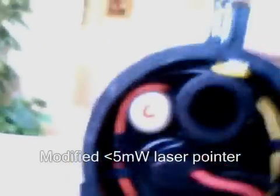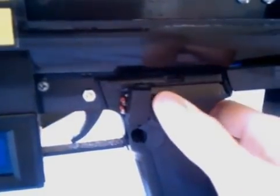The 5-volt output powers the digital voltage meter, which monitors the voltage level on the capacitors, and the 3-volt output powers the laser, and also sends the gate signal to the SCR. The charging process is begun by flipping the switch over the handle.